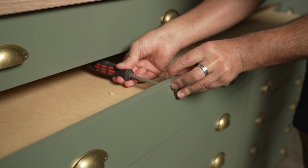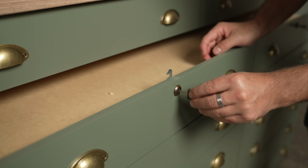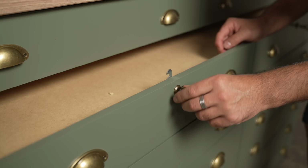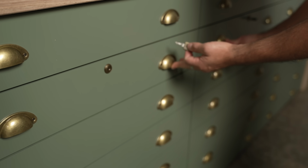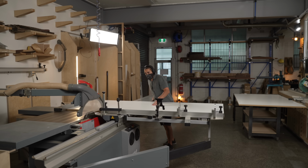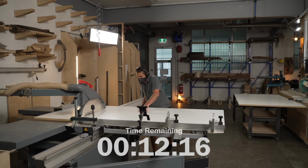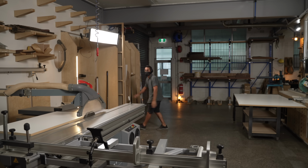I mentioned earlier that one of the biggest issues with setting up my vacuum bags is the fact that it takes up my assembly table, meaning that I can't assemble things whenever I'm vacuum pressing. The other issue with that temporary setup is the platens. Now, platens are panels that sit inside the bags and they have grooves cut in them to allow for airflow, which provides for even clamping pressure.